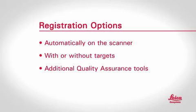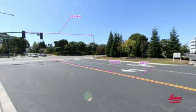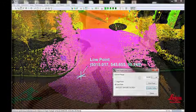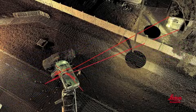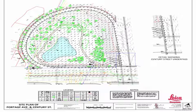A registered point cloud can contain hundreds of thousands, millions, or even billions of points. That's where your office software comes in — it lets users mine this rich information for an almost infinite variety of applications and deliverables, from simple ones like 2D plans and elevations, user-friendly panoramic images with geometric information instantly available from each pixel, clearances, point-to-point and point-to-surface measurements, high and low points, tie points, sections and profiles, volumetric reports, line of sight, and witness viewpoints and bullet trajectory analysis.